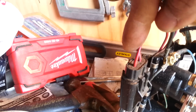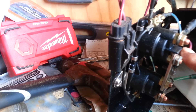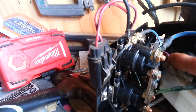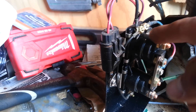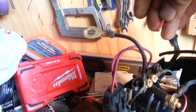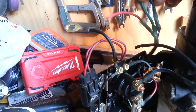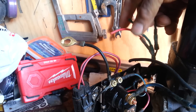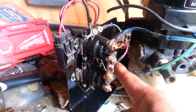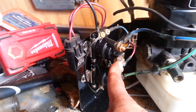This is the fuse — it's a 20-amp fuse. This one goes here and sends current to the switch, so the switch has power. This goes all the way to the red wire here. This one's going to be reconnected to the boat, and same with this one. These are the switches, so that's where that goes — it gets its live current from here.